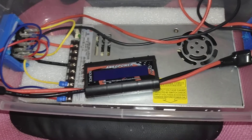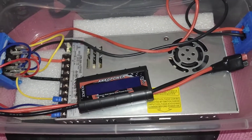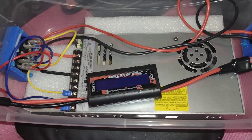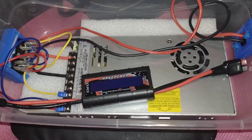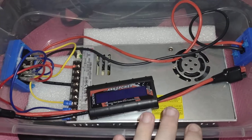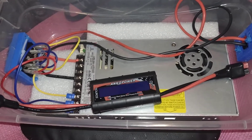For those of you who have seen other channels that do battery box builds, you can use a lot of the same stuff for that — just remember you're hooking all that up to your 12-volt output. If you wanted instrumentation for what you're drawing from the mains, you could put a separate meter on there, but most radios will tell you the voltage they're seeing on some screen. This will get you going — I don't see any reason why this couldn't be used for a simple base station, especially UHF/VHF at 50 watts, or as I was using it, 100 watts with the Icom 7100 — and it was fine.